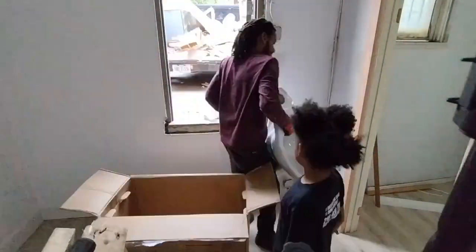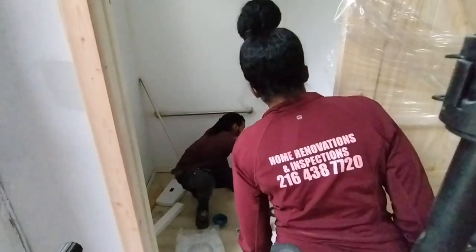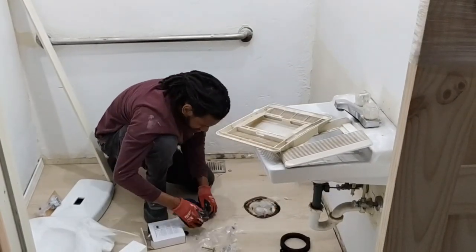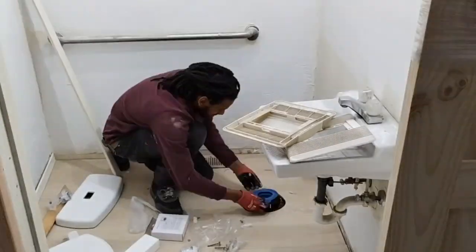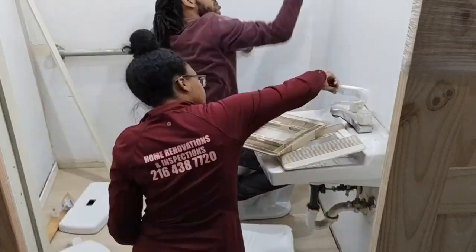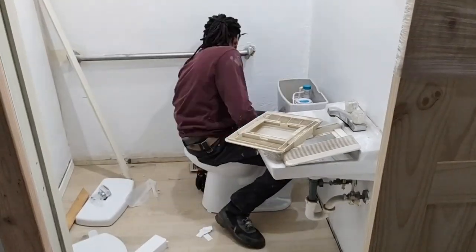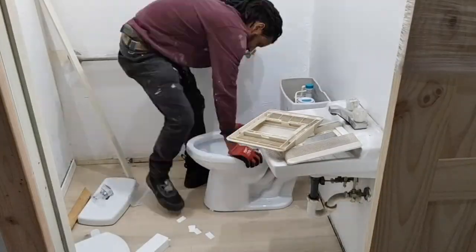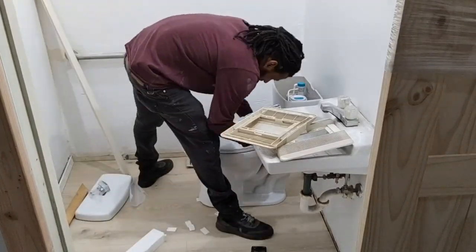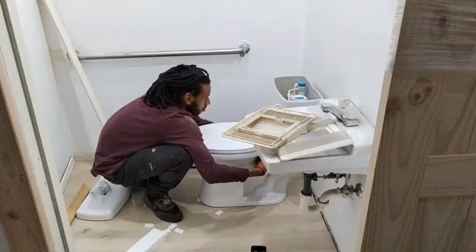This one was the same exact install, same toilet. Everything was exactly the same. The only thing that was different on this one here is that I had to install some shims underneath the toilet. I'll put that down in the description below — you can actually get them from Amazon. They sell a whole multi-pack of them, so you would definitely have enough. I went ahead and hit that with some paint too before we covered it up. There's the shims there. All you gotta do is stick them underneath, make sure it's nice and level. After you get it tightened down, just take a blade and cut those little tabs off that's sticking out from underneath the toilet.